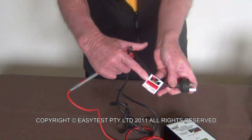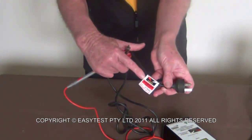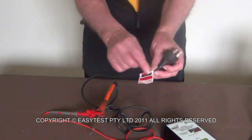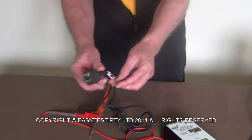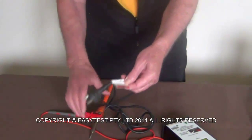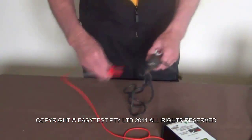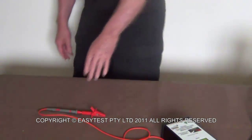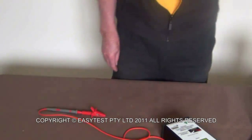Attach a danger tag. Don't attach a normal tag, attach a danger tag. The difference between a danger tag and a normal tag, the danger tag is red, and on the back there is no retest date. So we'll put that in quarantine, and we'll have somebody look at that.